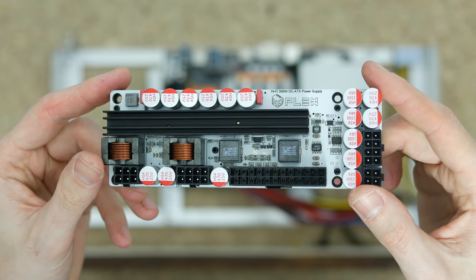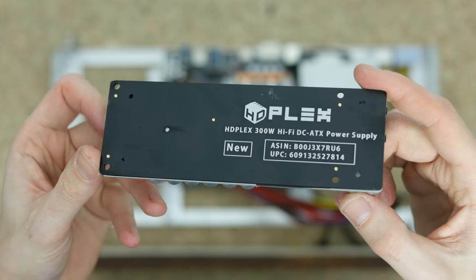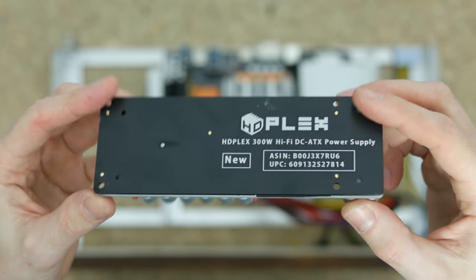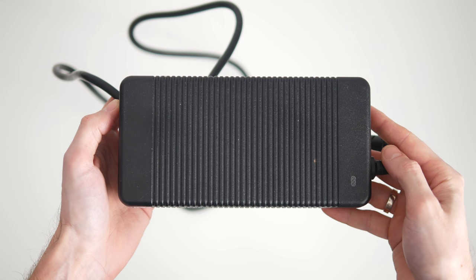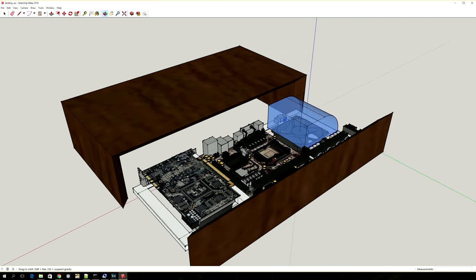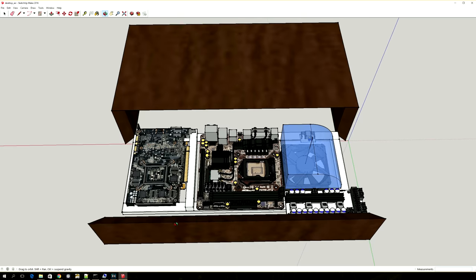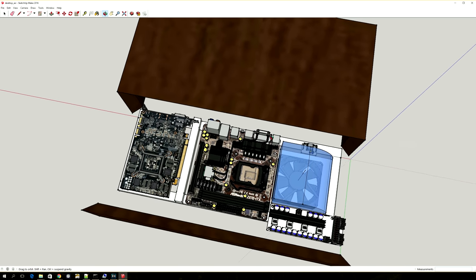This little guy is a very well engineered piece of electronics. It measures only 15x5cm and it can power a GTX 1070 and a Core i7 CPU without breaking a sweat, but it does require a rather hefty external brick to deliver. The CPU is cooled by a combination of the Noctua NH-L9i Zero's low profile radiator and a 92mm fan sucking the air from the bottom and pushing it towards the heatsink through a custom slash ghetto air duct.